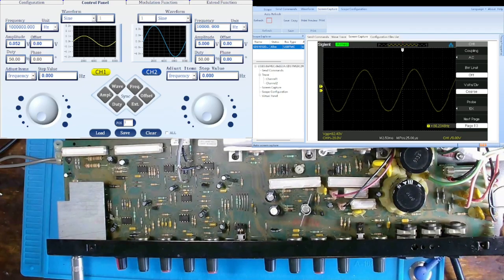Now, we don't test the focus, and I'll show you why here in a little bit. But now we're going to do the lead. The lead should be 15 dB boost at 1K Hertz. So, let's see. Where's my 1K Hertz, is what we need to set this to. I don't know why I said 80 there, that's 80 hertz.